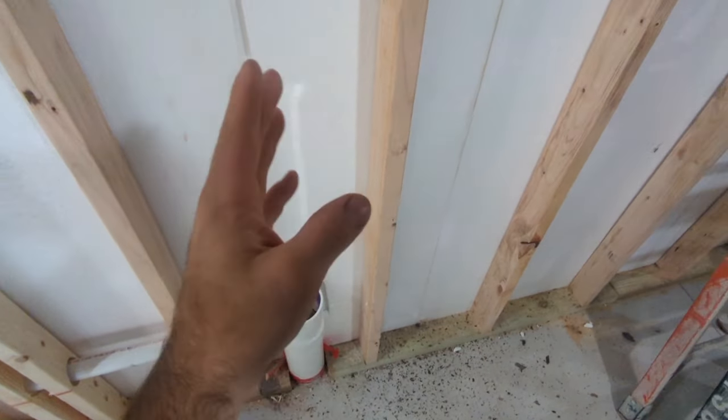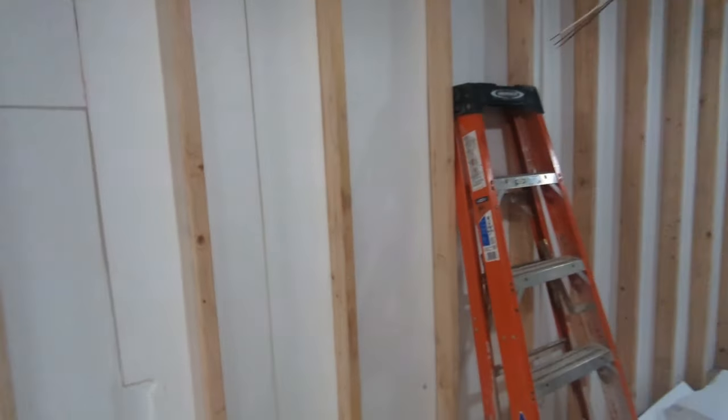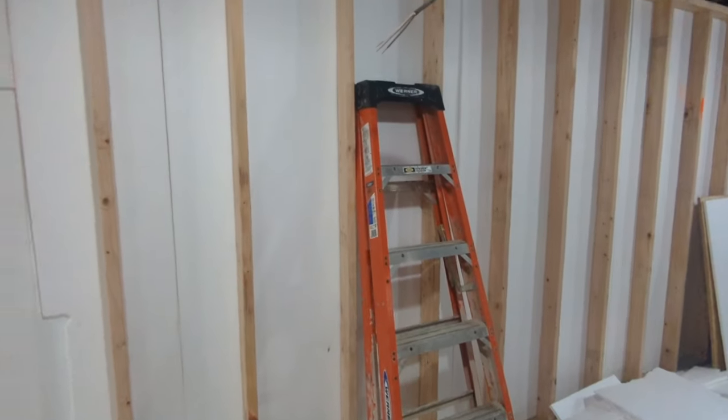And then we're going to probably, I don't know, the thing is when to turn and head over to the stack, and we're going to go into a reducing sanitary tee just facing the other direction. But should we fall way down and come over and go into it here on our way, or should we immediately come across the top and enter the stack higher up? It's 6 1/2 dozen to some extent there.